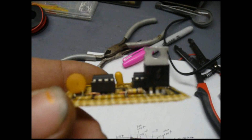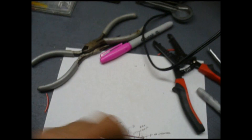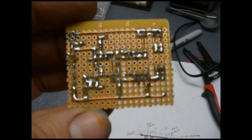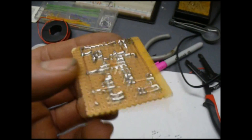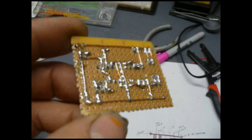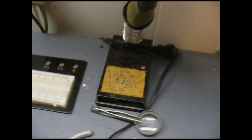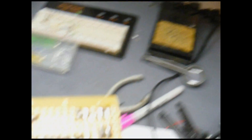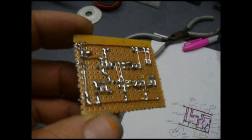Then I spent two hours soldering it all up — it seems like a lot of time for a small board. The reason is that on the back side, all of the traces are done by hand with pieces of wire and jumpered with a soldering iron. The trick I found is that when you want to jumper one dot to another, you cool off your soldering iron. I use the kind that just has a little sponge pad in the base — I don't have a temperature-controlled one. That's another thing on my wish list, along with the oscilloscope.